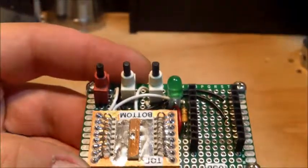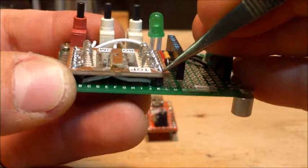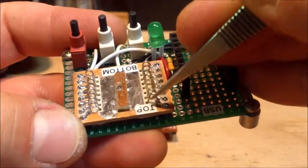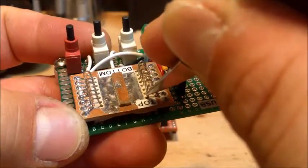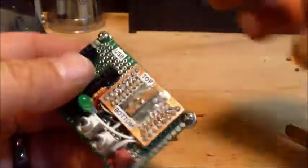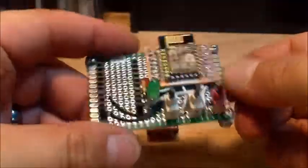that, let's see, let me get a pointer here. So they're soldered at this point, and they come over here to the male header, which goes down to this green board. But the wire is bent, and then it goes into this hole. It's a little oversized. It's bigger than the actual wire itself, so it gives it a little bit of springy action, just a little give, just enough to be able to take the ESP-12E and plug it into a socket. Righteous. So I got that done.